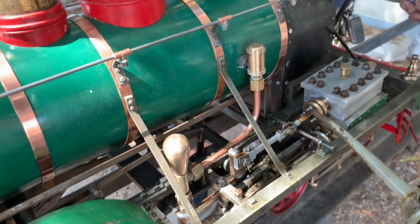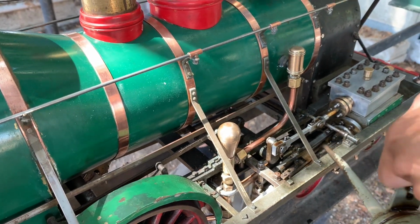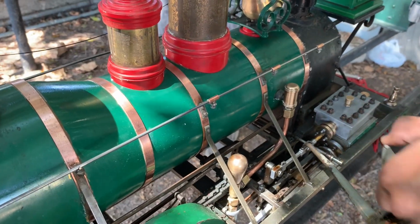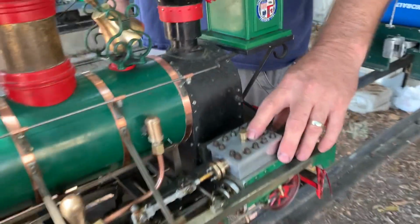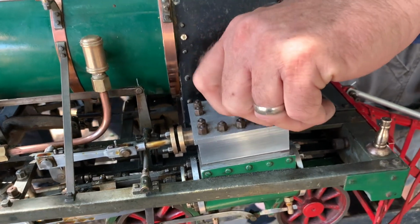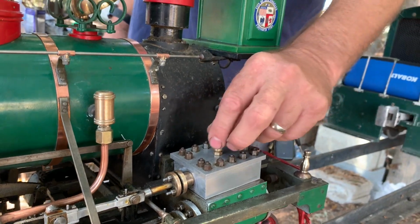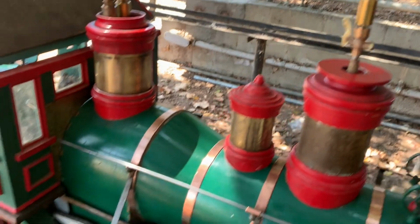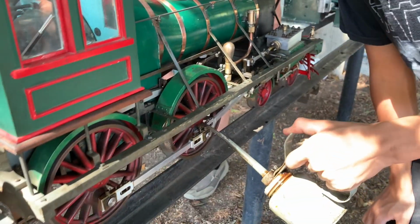which really helps, because otherwise you don't have a lot of lubricant. Our steam in these miniature locomotives tends to be really wet. The nice thing with these caps is if you're far away from the steam bays and you lose your lubricator, it decides it doesn't work, you can take these caps off and lube it straight there and then put it back on. It could get you back to the steaming bay without doing a lot of damage, in theory. That's what they all say.